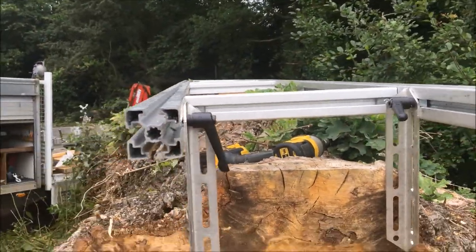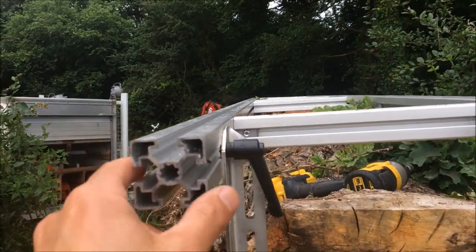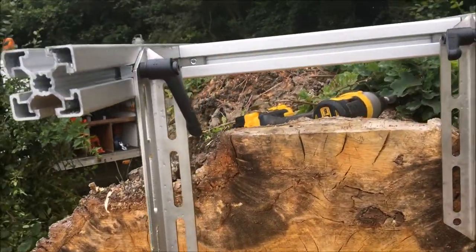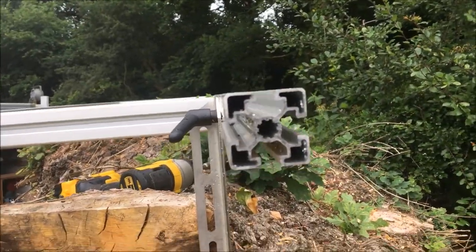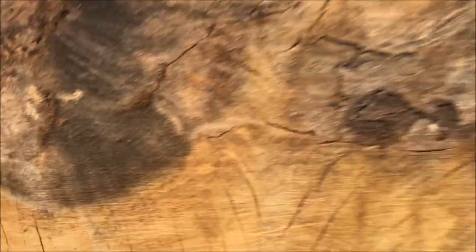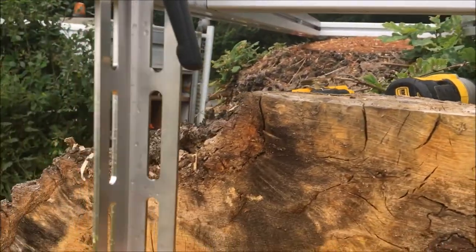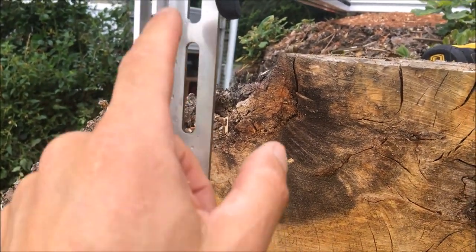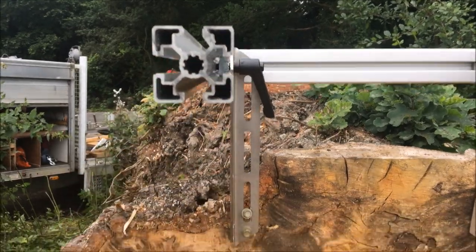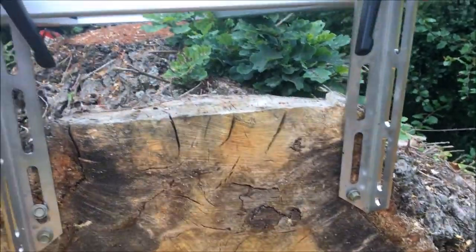On this end, the log just dips down a bit and it's causing the rails to twist, so we need to lift this up. I can see down that rail that it's dipping down towards me. I'm going to lift up on the right-hand side first and pinch it up so I know it's level. Then I'll put the other hex screw in the slot, lift this up and down to get it flat - absolutely dead flat. After you've got one pinched up in the slot, you can put one in the bottom hole and then it's going nowhere.